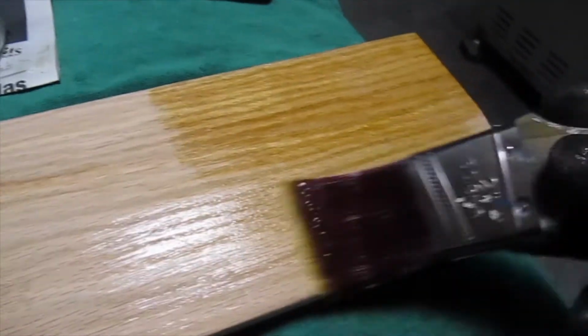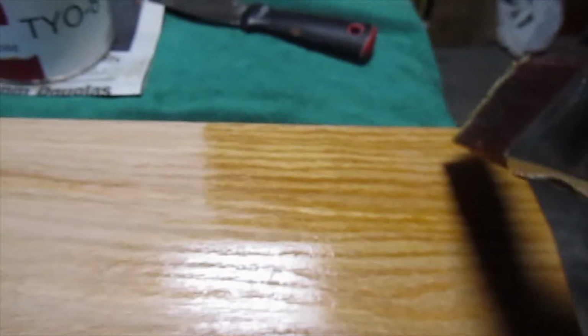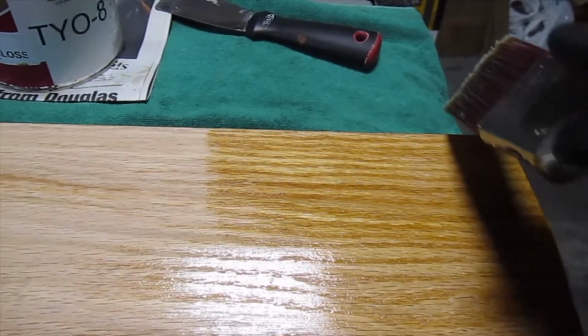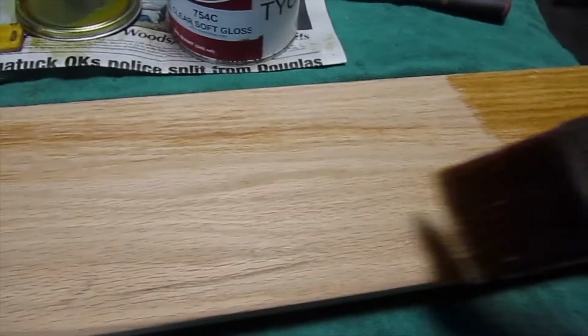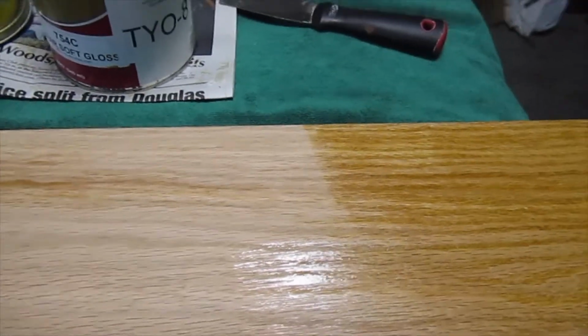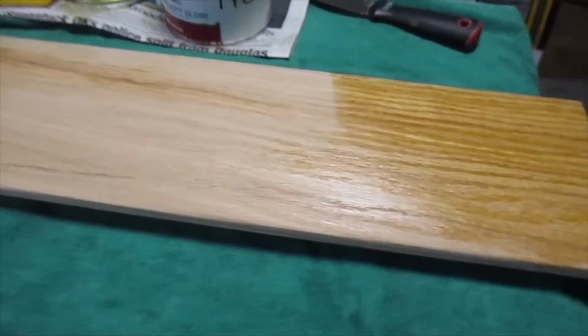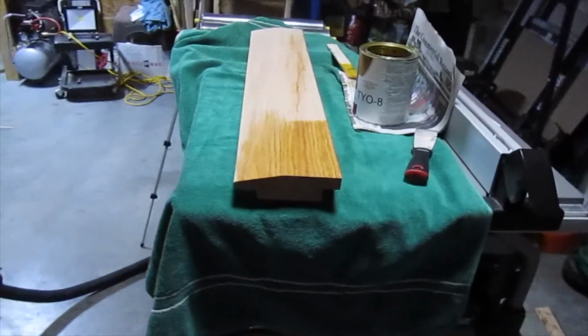and another coat tomorrow. And I'm going to have to probably run these thin little trim screws in, try to get it into the wood flooring, but also use construction adhesive to get this in place. And I think it'll work out just fine. So thanks for watching. This is the threshold piece into the hallway, custom.